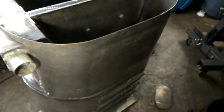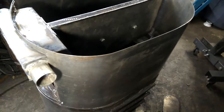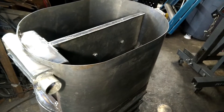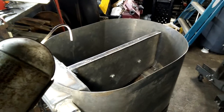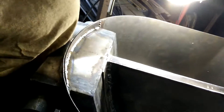It's a little more complicated than the standard setup, but the idea is we're getting some extra air preheating, some extra fuel preheating, and hopefully we'll gain a little bit of efficiency. Plus it's a little more compact. The overall dimensions: with the lid on it's 39 inches to the top; without the lid it's 36 inches. The narrow direction is 21 inches and the long direction is 29 inches.